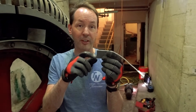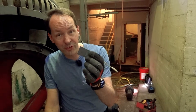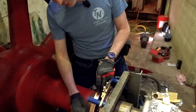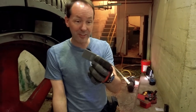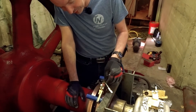Any motor where you see a little tiny spark in the back if you look inside through the fins has one of these in it - this is where the sparking is happening. What this is is a piece of carbon with a wire impregnated in it, and this passes electricity into or out of a thing that is moving. Depending on the type of motor, the thing that is moving may be a slip ring - a continuous conductor all the way around - or it may be a commutator, which is what you're going to see most of the time around the house. This part's going to be here for a hundred years; this part's going to get replaced pretty quickly after fumblefuck turns it back on.